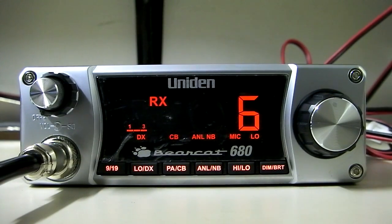Hopefully you guys have a better idea of what this radio is all about inside and out. We did give this radio an on-air test, and receive was very good — what I would expect out of any AM radio I have here. It seemed very good in the mobile; heard some DX rolling in, no problem at all. The ANL noise blank seems to work pretty well cutting out the static in the vehicle. The radio is going to dead key about 3 watts from the factory stock and will swing up to around 8 to 10 watts peak, so it did have some good forward swing.